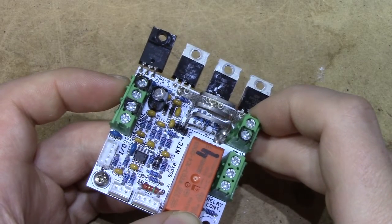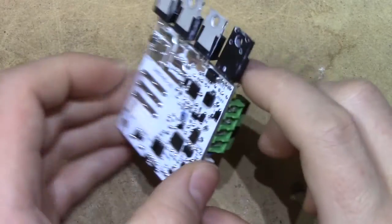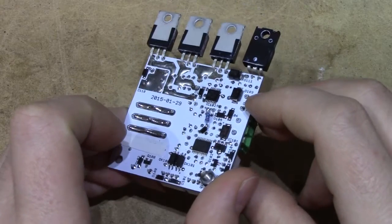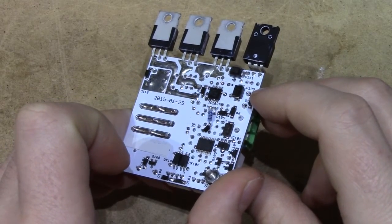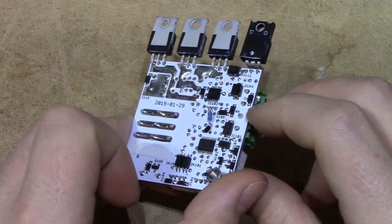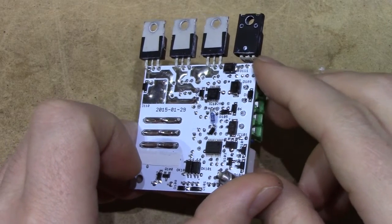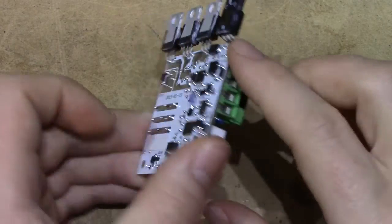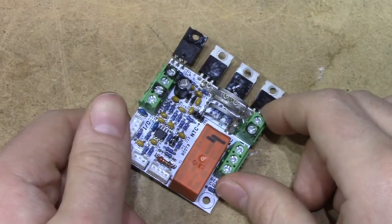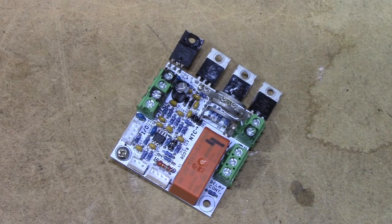You would basically require some form of water cooling in order to run a so-called passive system on this. That basically sums up the purpose of this unit — it's a 10-amp data-logging constant current sink, which can be programmed from a computer in order to do basically anything. The current is adjustable through the PC interface as soon as we get the firmware running properly, and the logging is going to go to the computer as well through RS232. It's going to be a rather nice battery testing device — I'm going to be able to pull very exact discharge curves out of my batteries, and it's also going to be able to characterise power supplies over time.